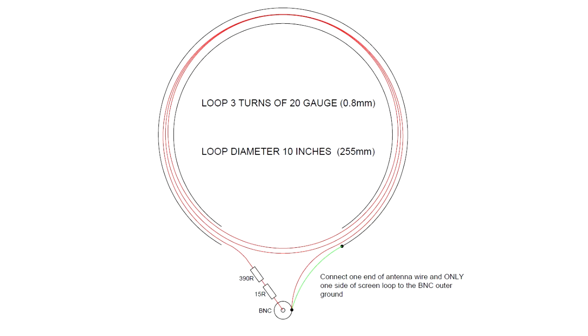I mean, you could try and bend it over your knee or something like that. It's easy to form a 90 degree bend in copper or brass tubing just using standard pipe bending tools. But to form a circle or a C shape, I think that would be difficult. You could certainly do it, but I think it would end up looking a little bit lumpy.